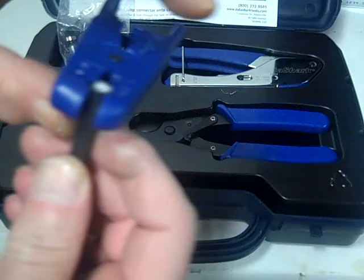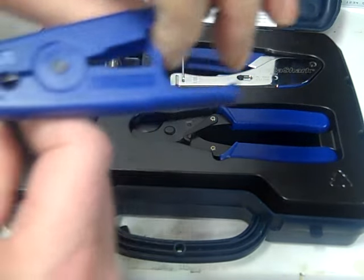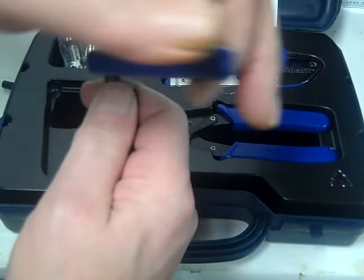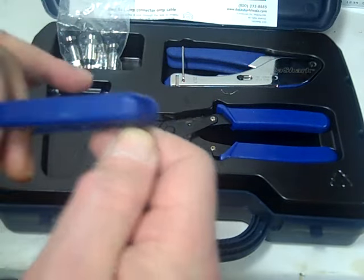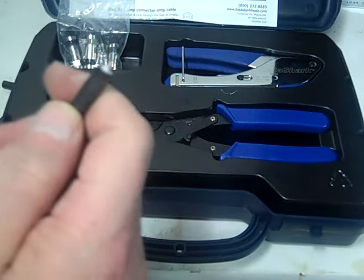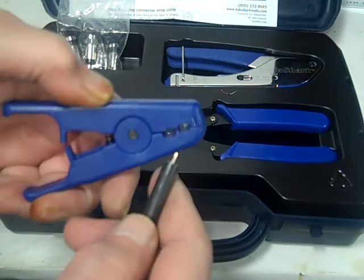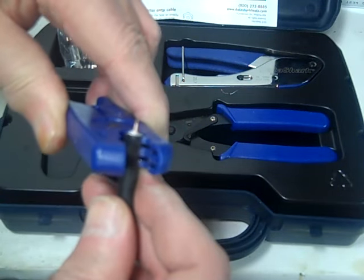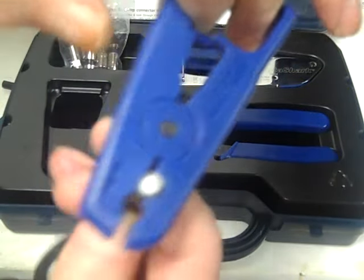Stick it right to the edge like this, flat. That's it, squeeze it together. Now you see this arrow on there — that's the way we're going to turn this. No matter if you turned it upside down or whatever, the way the arrow is, is the way you're going to spin it, and this will come right off. See, nice and clean. Got a quarter of an inch there. So now we're going to do the next quarter of an inch off this jacket, so we're going to put it up to the edge again. See that? Squeeze, rotation of the arrow.